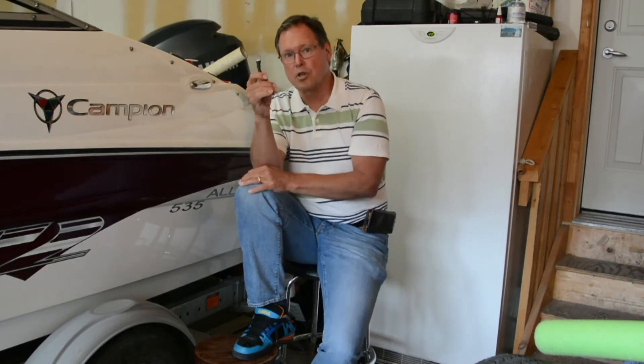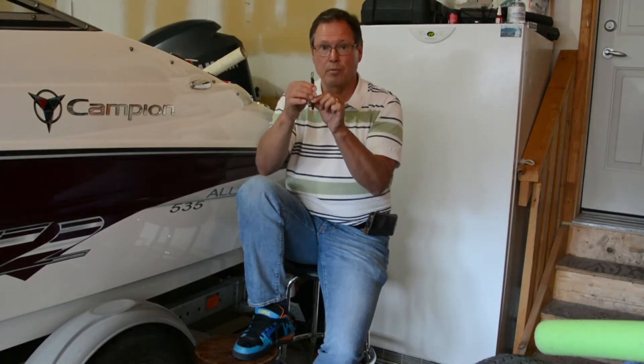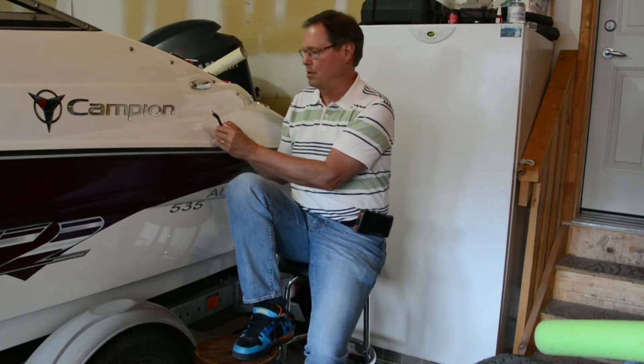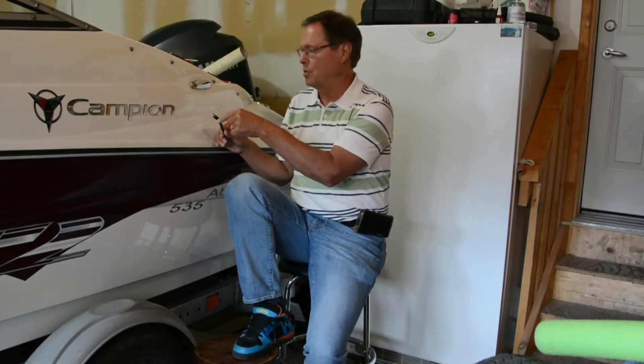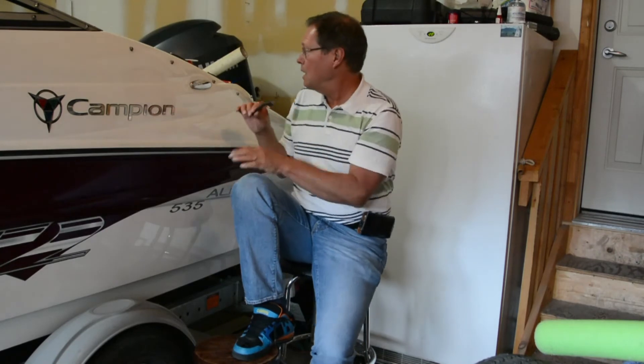Most of us don't have a $300 heat shrink gun, so you can use a paint strip gun from the hardware store — they generate quite a bit of heat. Two things to be careful of: don't overheat the heat shrink or it'll split, but at the right distance the glue will set and you've got a waterproof connection over that solder joint. Also, always be aware of where the heat is going — it's easy to accidentally melt something on the boat behind where you're working.